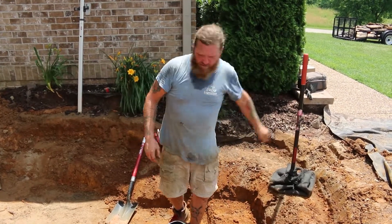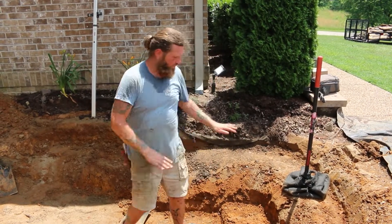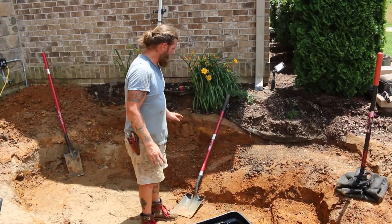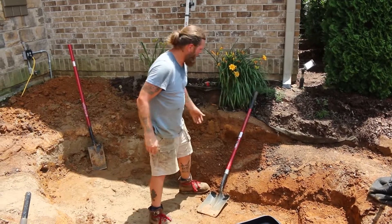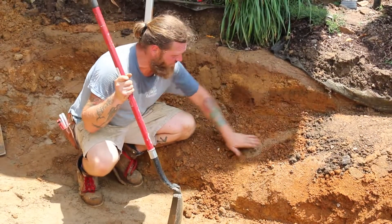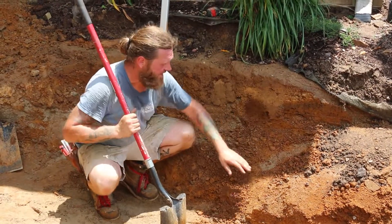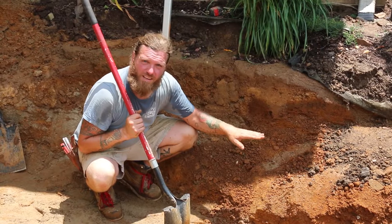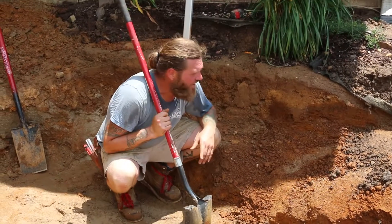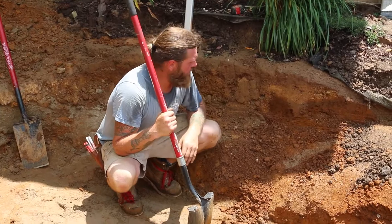So we got our shelves carved in a little more vertically, put in a couple of extra shelves where dirt kind of fell in and we didn't want to touch it twice. There are a few spots here that we're going to have to backfill as we go — we can't stack rocks on this, it's too not cool. Building term, by the way. So we'll get our bottom shelf stacked in, flip the liner back in, and then backfill with dirt behind here. We've got four or five wheelbarrow loads of dirt to use somewhere.